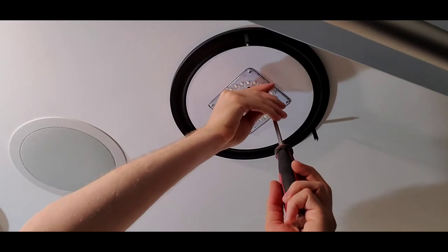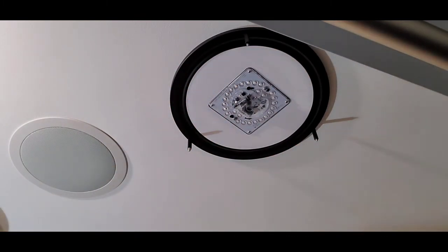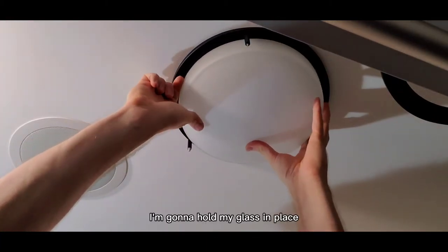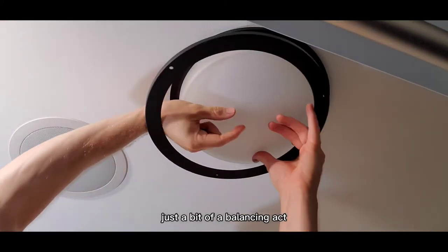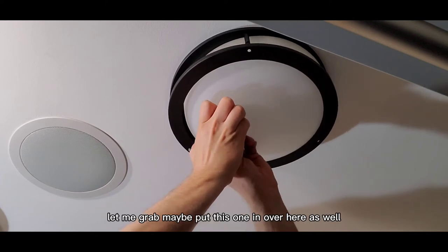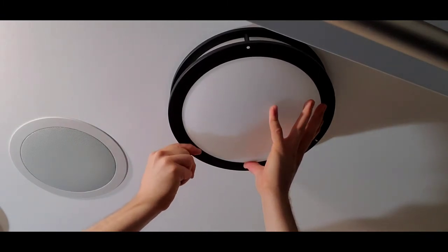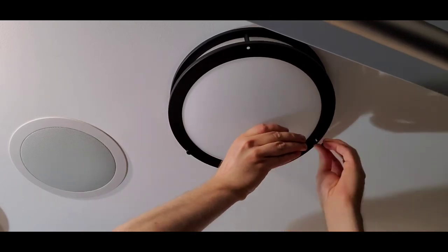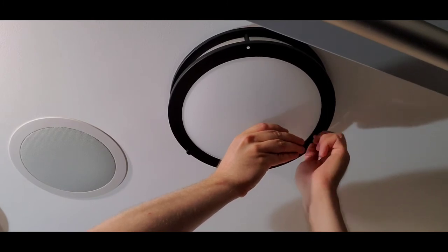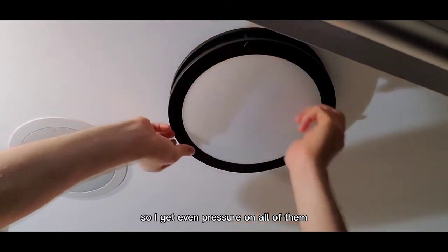It takes a little practice to get this right, but once the screws are through you twist the fixture a little bit and that's going to lock it in so it can't fall down. Then you tighten your screws — you don't have to go too crazy tight because you don't want to crack anything and it doesn't support a lot of weight. It's now flush with the ceiling. I'm going to grab the cover and the three screws that secure it. I'll hold the glass in place — it's a bit of a balancing act to get the screws lined up. Get the first screw in closest to me, then a second one, and now I've got a free hand to finish screwing in the little nuts that secure the frosted glass.